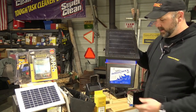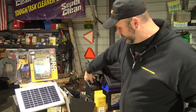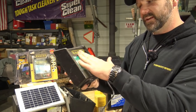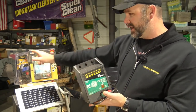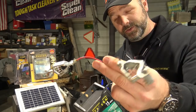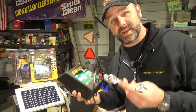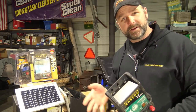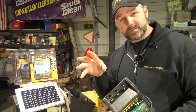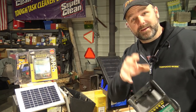You'll see the Premier One fence brand over here — I am a huge fan of Premier One products and we'll get more into that as we go. This here is also a DC-powered Zareba brand, a 15-mile that puts out one joule — so that means 10 times more power than the 5-mile. You just hook it with clamps onto a 12-volt battery, like a car battery or a deep cycle marine battery. The reason we're doing this video is to educate you as to what your options are if you're considering purchasing livestock and using electric fencing for chickens, goats, or cows.